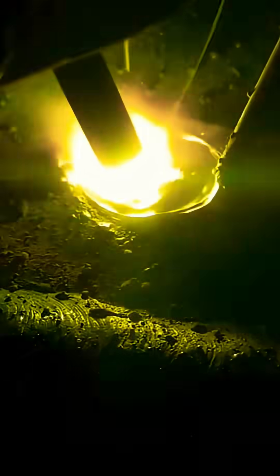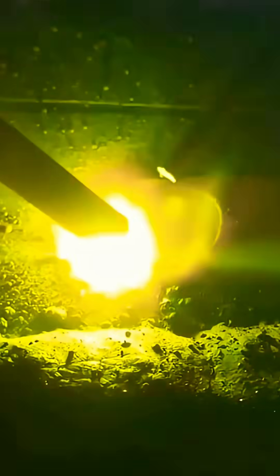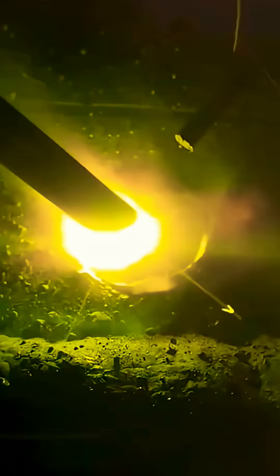When we weld, it is essential that the molten metal and the keyhole are well separated from the slag. If during welding you feel like the keyhole and molten metal are uncontrollable and keep mixing randomly, that means you're about to trap slag.